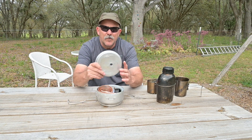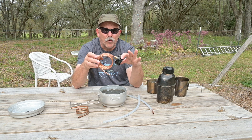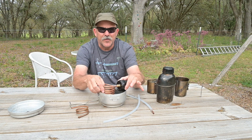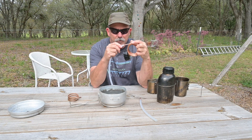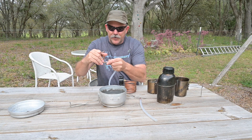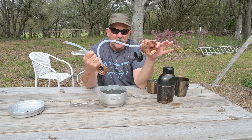Let's go ahead and open it up here. We've got our lid, tubing, condenser 1, and condenser 2. Our primary condenser is a ¼ inch copper coil attached to a canteen lid with a compression fitting. The inside of the lid is backed up with a thin stainless insert below the silicone seal. The placement of the condenser in this location allows for the assembly to be compact enough to stow in the mess kit as well as be used effectively as a primary condenser. The discharge of condenser 1 is connected to condenser 2 with this high-heat silicone tubing. This tubing will withstand 200 degrees centigrade, but it will not handle direct flame impingement. The discharge of condenser 2 we're going to connect to our collection tube. And this is our distillation apparatus set up.